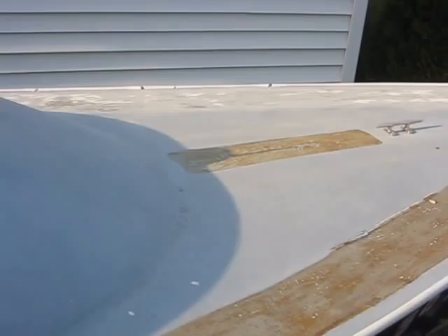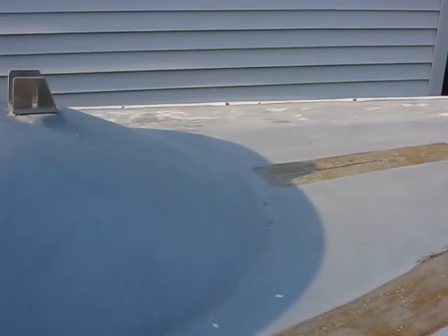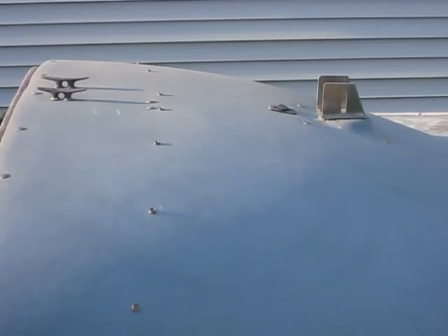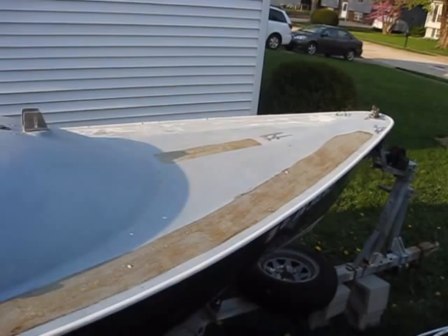The paint — there was no blistering. It looks like it's mechanically held. But when viewing various topics about painting boats on the internet, it says to take it right down to the bare fiberglass and remove all the hardware. The hardware was a point of contention because lots of it is bolted and there's no access to the underside of the bolt.